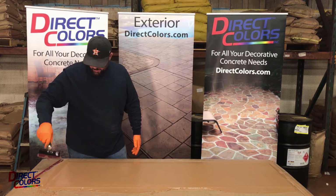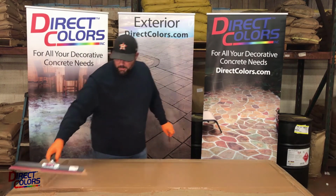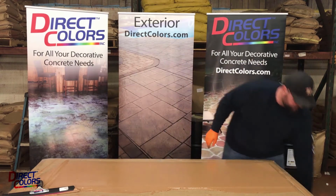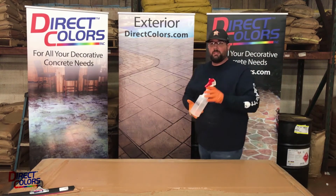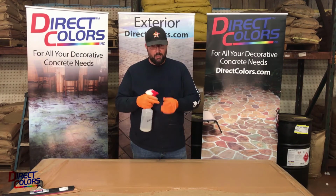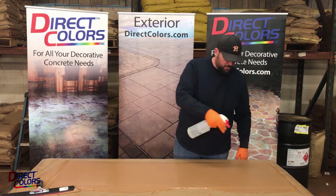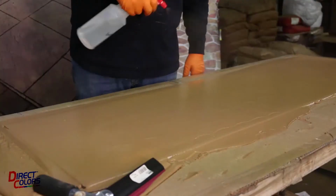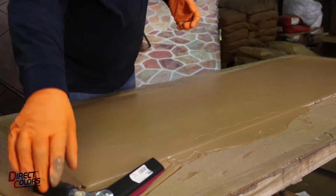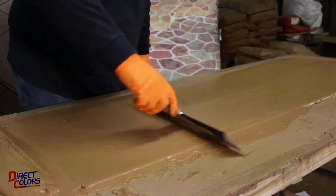And we're just smoothing. Now at a certain point, the material will start to get a little bit dry. And if that happens, it's not anything to worry about. Get you a little spritzer bottle like this, just plain water. You could also use a liquid tool release, but you could set this to where it's got a little bit of mist, and you could mist the surface of your overlay a little bit. What that'll do is allow a little bit of that cream to come back up and give you a little bit of a softer finish.